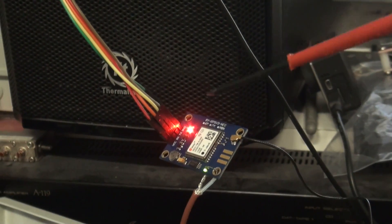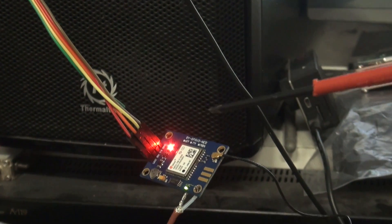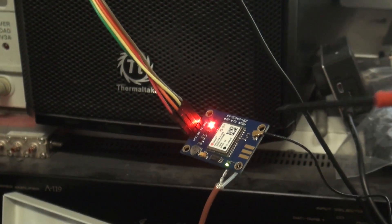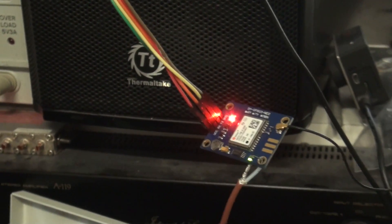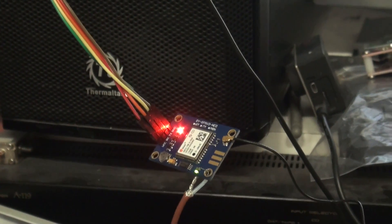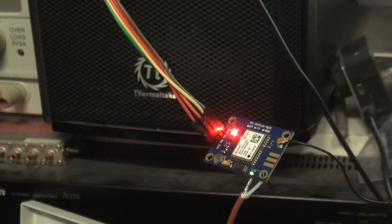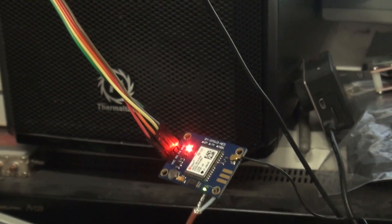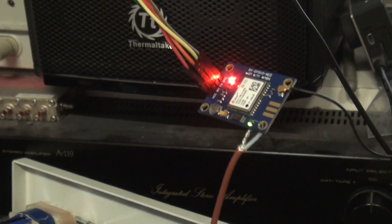Keep in mind that this is not a GPS disciplined oscillator. It basically uses an NCO to generate the frequencies. If you were to connect the output to a spectrum analyzer or an oscilloscope, you'll find that the output is actually quite ugly looking, quite dirty. It's not the ideal output to use to reference lock communications equipment or whatever. But just to lock a cheap frequency counter like this — perfect, not a problem, it all works great. There's absolutely no drama. Very, very cheap. Very easy to implement.